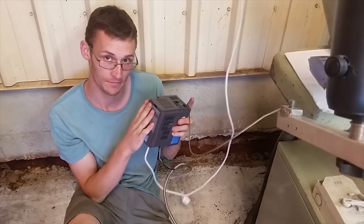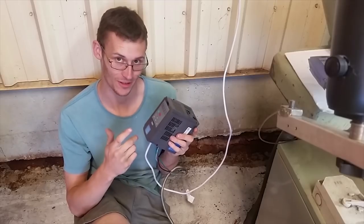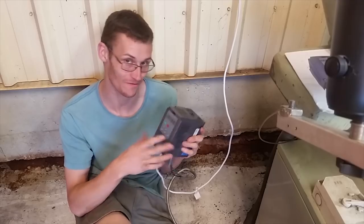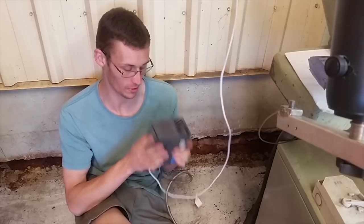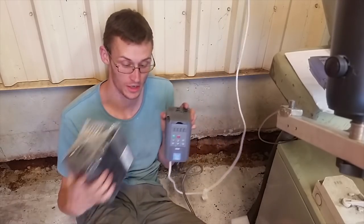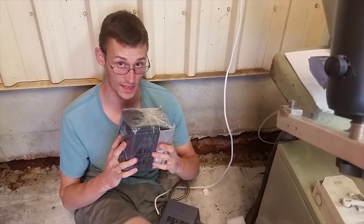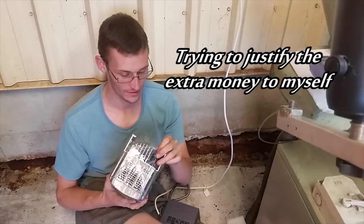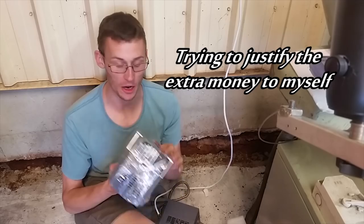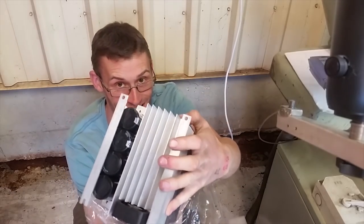So I started out with this guy — turns out he's not big enough. This is 240 volt three phase output. I thought it was 240 volt input to then output three phase 415 volt. No good. Technically it runs the motors but way too slow. So we go from this guy to his big brother. All up I need close to two horsepower — this is actually five horsepower, the smallest one I can get. For a surface grinder it needs to be running continuously, so more capacity is better. Look at the heat sink and the capacitors in this guy.